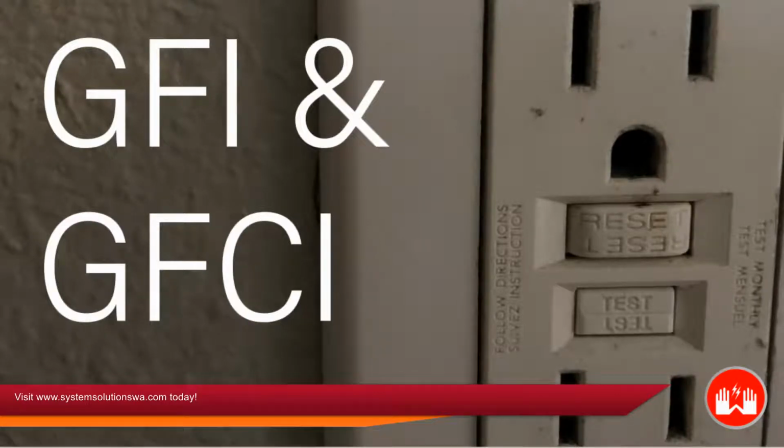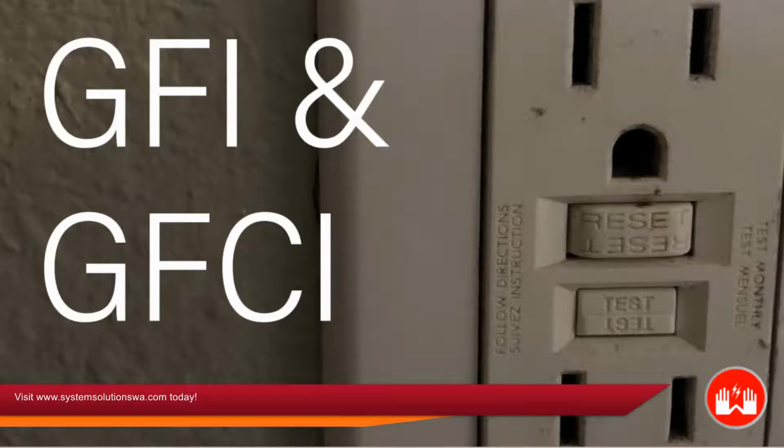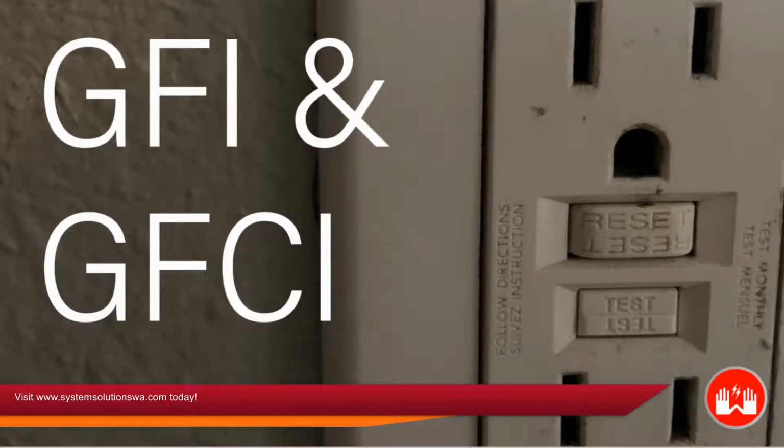To fix this issue, you must unplug your appliance first. If the GFI breaker is tripped, the reset button will be sticking out on most outlets. Next, press the reset button. Do this for the other outlets on the circuit, if applicable. With a click of the reset button, the power should come back on. If you continue not to have power, press the test button and then hit the reset button again.